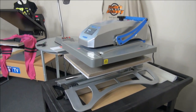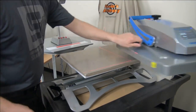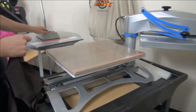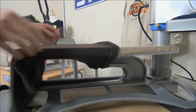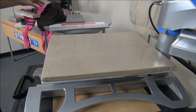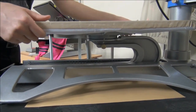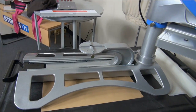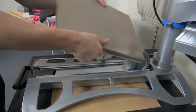When you start to talk about printing youth size shirts — and we'll kill two birds with one stone here with a youth shirt and script with tail — you get a shirt that if you're threading just cannot be split and threaded over without warping. So what you can do with most Stahls presses is interchange the platens with a simple click out, swap off the 16 by 20, and drop in the 11 by 15. Obviously that changes how the lasers are configured.